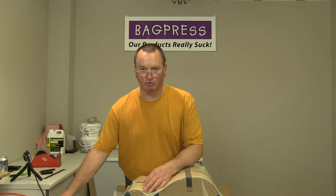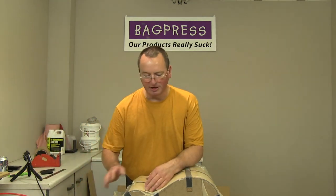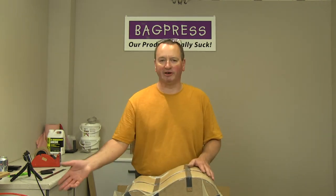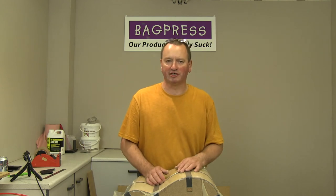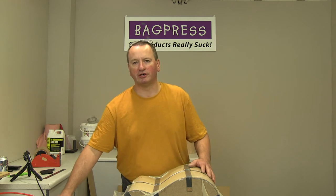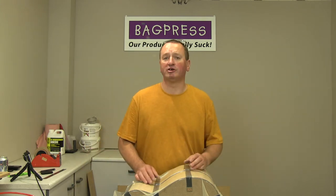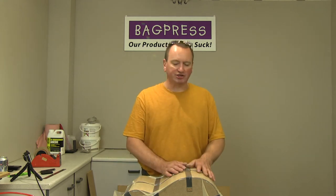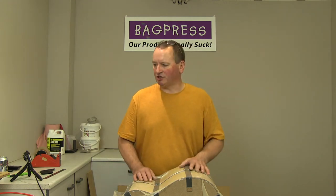I'm going to stop the recording now and just go and wash the glue spreader before the glue goes hard. And one really important thing to remember when you're washing a glue spreader that's being used with UF resin is do not use hot water, because hot water will kick that glue off very, very quickly and you end up with big lumps of hard glue in your glue spreader, which is very tricky to get off. So I'll just use cold water, rinse it out, take it apart the same way as you saw, reverse it when you're putting it together earlier. And then I'll be back in 10 minutes or so, at which point we'll turn the heater pads on.